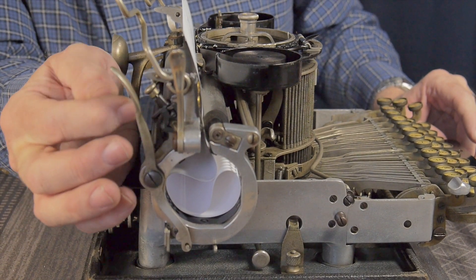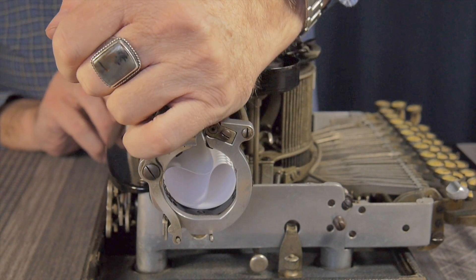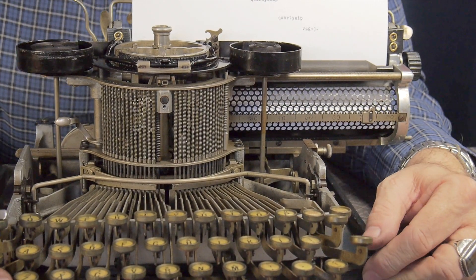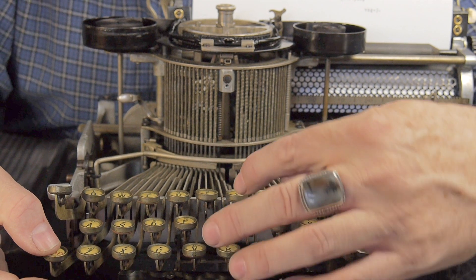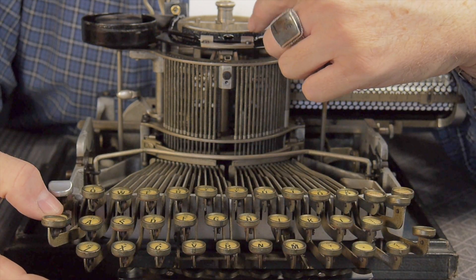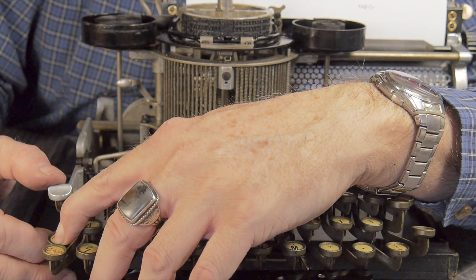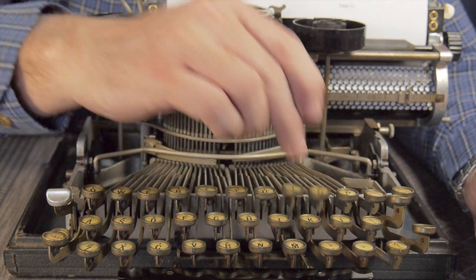Some other features: line spacing selector here. This is the carriage release — it has a heavy spring to bring it back to the beginning of the line. So right now we're in single line space. This is a three-bank keyboard, meaning the type is in three rows: lowercase, uppercase, and symbols. To print the lowercase G, just like that. To print the uppercase G — shift. And then for figures, which are also numbers, you'll see that the anvil goes way up. This little button here: if you were typing a lot of numbers, you can press the figure button down — it's like a shift lock for figures. Now it will print all the numbers without having to shift.